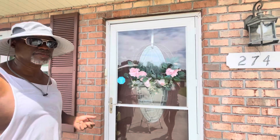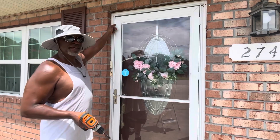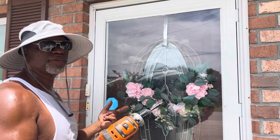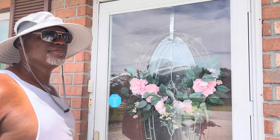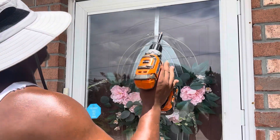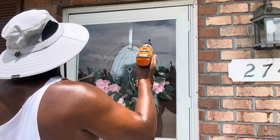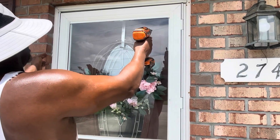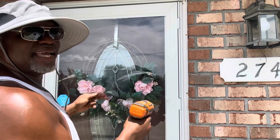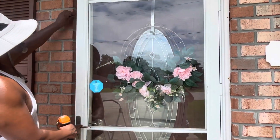What can help you sometimes to level? Obviously, you use a leveler — that way you make sure it's nice and level. But sometimes you want to use little spacers in here, and that will help you. Because a lot of times what people do — let's just say a beginner — they install the door, and just because it looks level, just because it looks like it's in there nice and snug, doesn't mean it is. A lot of times when they have it in, they don't realize it'll slightly be off. It'll be so minuscule that you don't even see it. And then once you get everything in and it looks good, when you go to open and close, you keep getting something like — clank, clank.